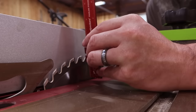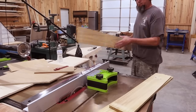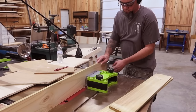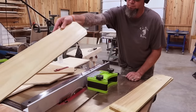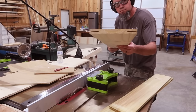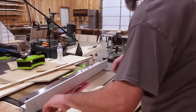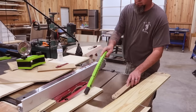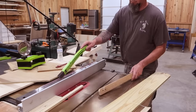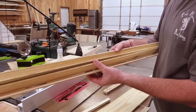But first, while our saw is still set up, let's go ahead and cut our half shingles — just dropping the blade down to an inch and an eighth. Now once all of those are cut, we can go ahead and rip it down. We'll lower our blade, set our fence at two and a quarter for the full size shingles and an inch and an eighth for the half shingles. This will allow you to get four shingles out of every three and three quarters inches of material.